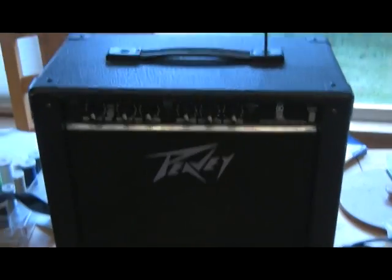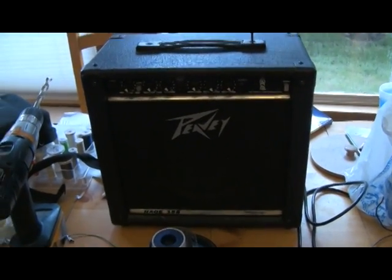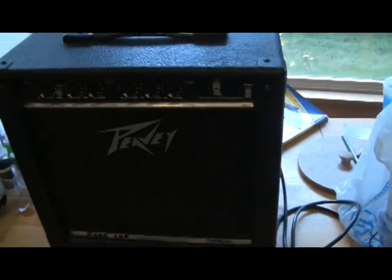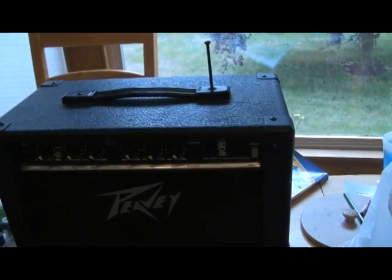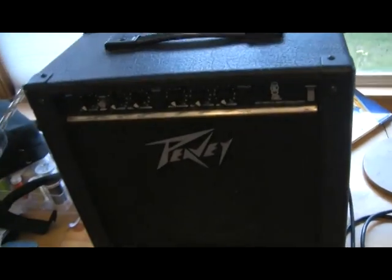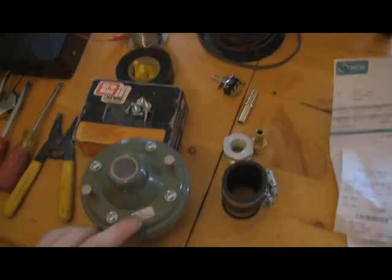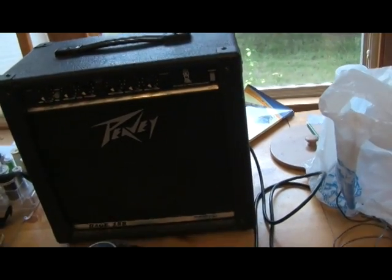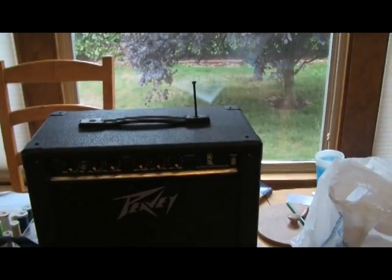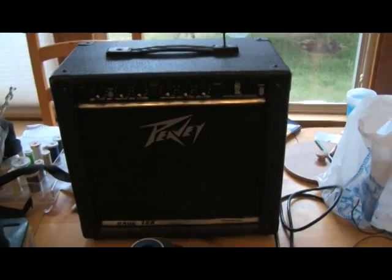One last object you're going to need is an amplifier. This is not the biggest amplifier you'll ever see a talk box made out of. Anything smaller than this particular amp I would not use — it's 15 watts. Anything bigger is fine, to a point. It's also 4 ohms, and one particular thing you do have to check to make sure it's compatible: your horn driver either has to have the same ohms, or your horn driver can have higher ohms — otherwise you could mess it up or break it. I don't know what amp you have, but now would be your time to take it apart.